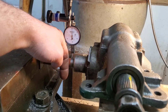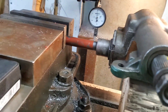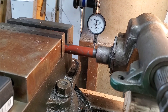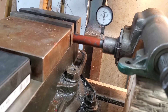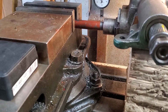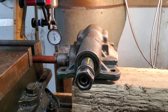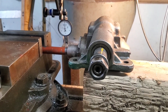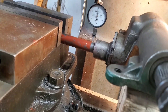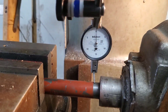The cutter could be sticking clear out the bottom and really be cutting deeper on one side, but because I'm going to cut one side, pick up, move over, cut on the other side — it's really not going to make a difference as long as the mill trams straight, which for anything I've done with this, it's been good enough and should be good enough for this project. If this was actually a high tolerance part, I would go through and check it because you never can be sure unless you're the only one in your shop. It'll be good enough for this, and I'll check it as I go along with micrometers to make sure it's not goofed up.